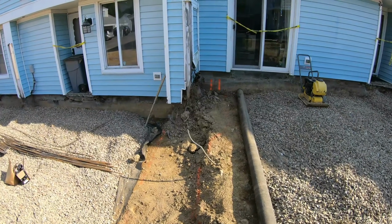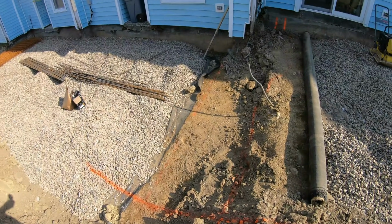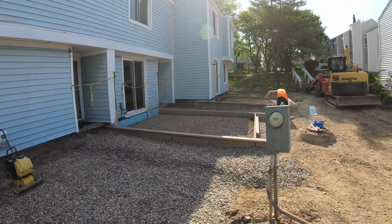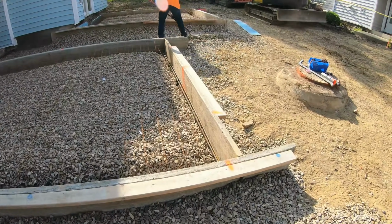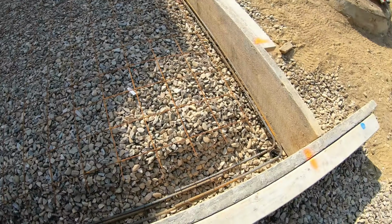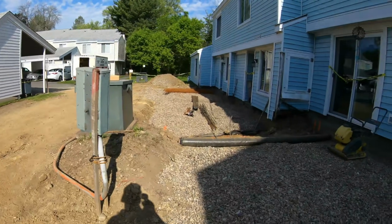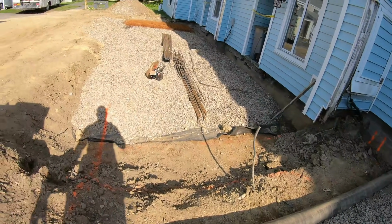Got to expose that conduit and get that footing installed, so when we pour these pads, which you see are all formed up. Got the wire, got the rebar, got chairs for the rebar, and we'll also pick that rebar up. 2 pads already there, so when I pour that, the excess, I'll order an extra yard and pour that.